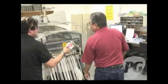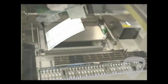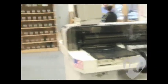We've got this machine here with two heads, and each head has 12 nozzles. While one head's picking up parts, the other one's dumping them on the board. Originally, when I first came here seven years ago, we only had this older machine with two heads with two nozzles on each head. So this machine here is more than 10 times faster than that. Come around on this side and you can see these little heads doing their robotic work.